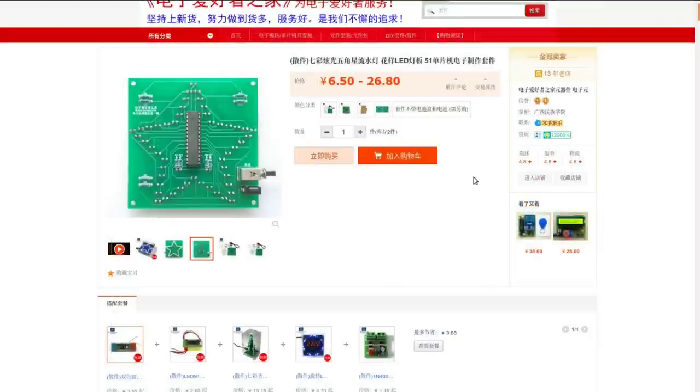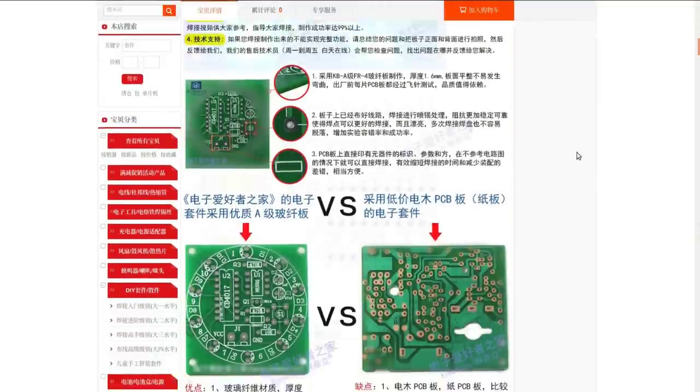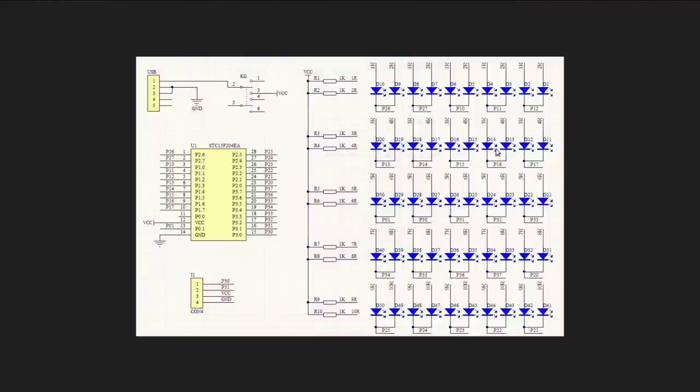Okay. Now, do they have any instructions or manual or anything? Oh, so this looks different from the IC Station one. Okay, so it's using 25 pins on the negative sides to control each pair for a total of 50 LEDs. And then half of the LEDs of each pair go to one resistor and half go to the other. So it's a little bit naughty that way. Since they're going to be probably multiplexing them fast, there's only going to be one LED worth of current being drawn through each pin through the resistor. So other than that, there's not a hell of a lot to this thing electrically, so I guess we might as well just get to building.